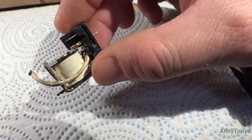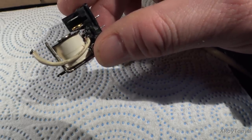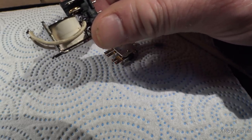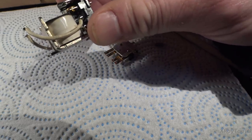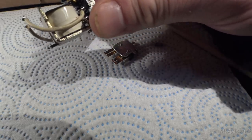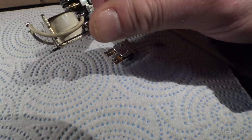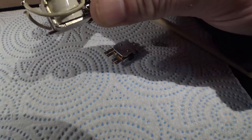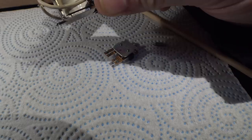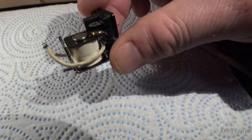That's why I keep telling everybody in a lot of my videos, don't turn the volume way up and then turn your stereo on, because when that high volume switches in, you're switching a high voltage. It could be 20, 30, 40 volts, depending on if it's a really high-powered amplifier. You can be switching that voltage right into a low impedance, 8-ohm, 4-ohm, whatever it is, load. And because it's a reactive load, it can actually be even lower than that. So instantaneous current can be very high, which will damage these contacts.